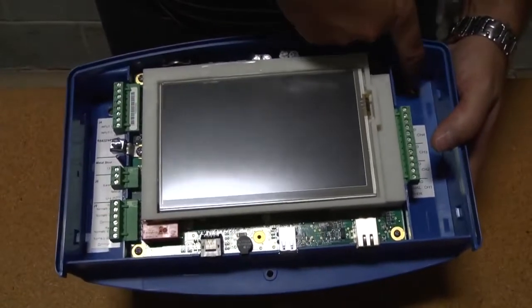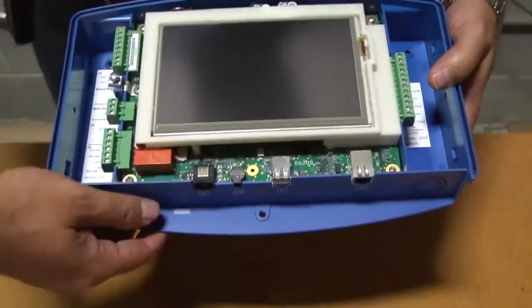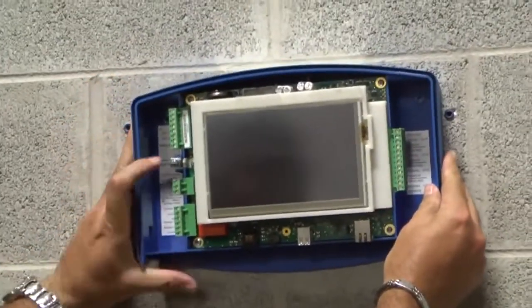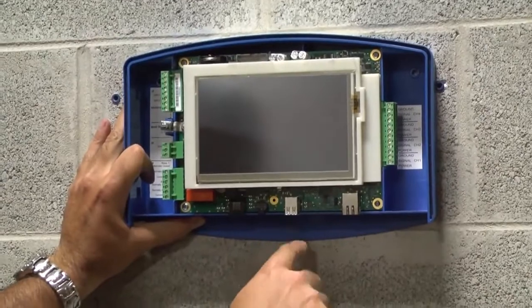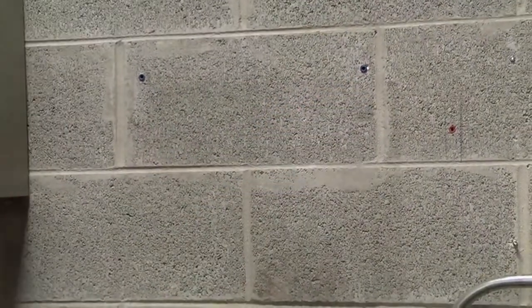When you're mounting the box, you'll have two mounting lugs at the top as well as a center mounting lug on the bottom. Bring the Nano box to the wall, make sure that it's level, take a pin and mark your mounting holes, and just drill and tap — either putting it directly into the concrete or using mollies to hold the screw.